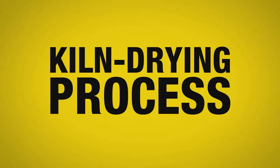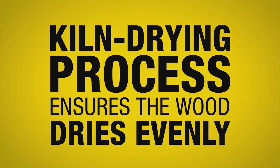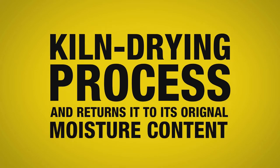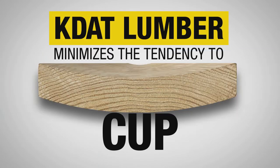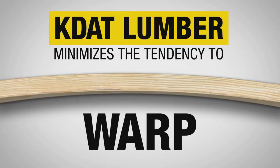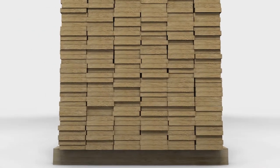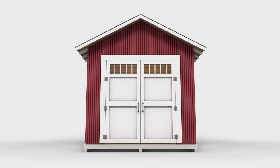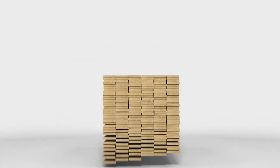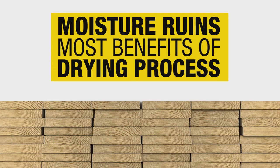The kiln drying process ensures the wood dries evenly and returns it to its original moisture content. Kdat lumber minimizes the tendencies of the wood to shrink, cup, or warp, but only if you store it correctly. Make sure to keep it elevated off the ground and completely covered and dry prior to installing it. If it gets wet before it's installed, most of the benefits of the controlled drying process are lost.